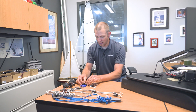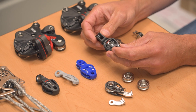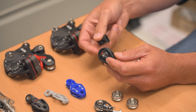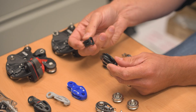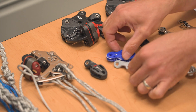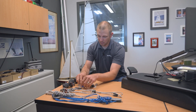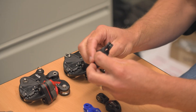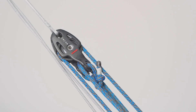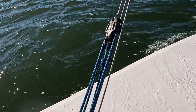Initially we tried a full 90-degree twist, but the feasibility of injection molding that part — making it strong enough, structural, and assemblable — just wasn't going to work. So we asked how much we really need to twist the fiddle to give enough space for the lines, and we said let's try 45 degrees and see if it worked. It's something we've never done before and I don't believe any of our competitors have done it before either.